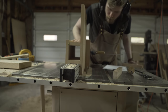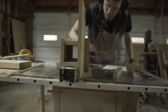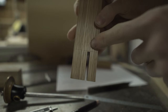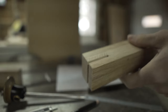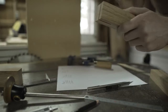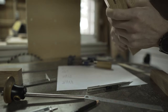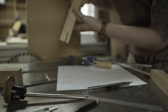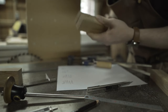I'll go ahead and make a cut. I've got about half a mil to a mil to my baseline there — I want to leave that and chisel down to the line for absolute precision. There's nothing more accurate than a sharp chisel to a baseline. Checking how accurate that cut was — pretty accurate, I'm happy with it. Since all the marks were set off the faces, I can just keep spinning the piece around until I have all the cuts made, then cut out the waste with a fret saw and chisel out the rest.